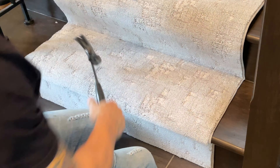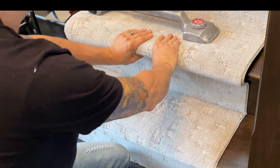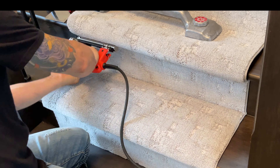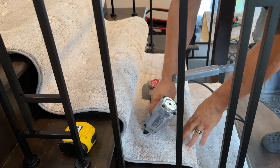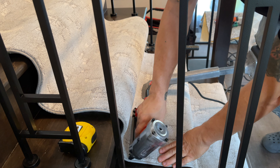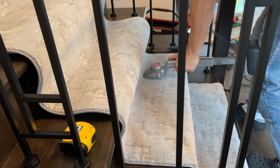There is no smooth edge on these stairs. I've brought the pad as far out into the corner as I can to get that nice edge. Now we're folding and pre-forming under the nose on a 45 — here's a side view. Stretch in the middle, get those three staples on the outside, rub those staple marks out, same on the other side.